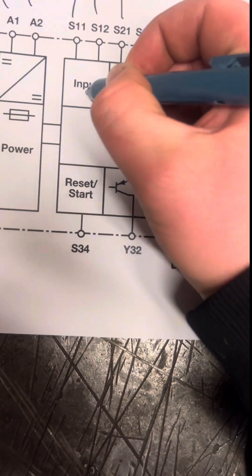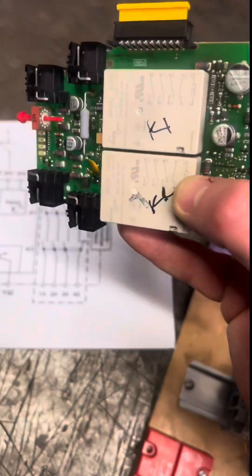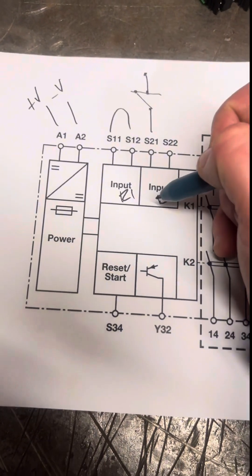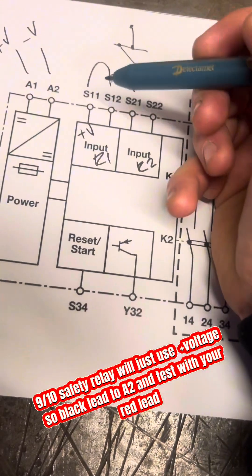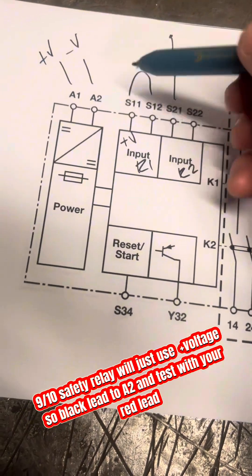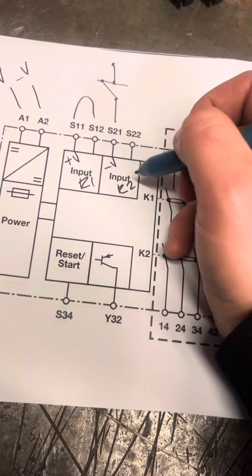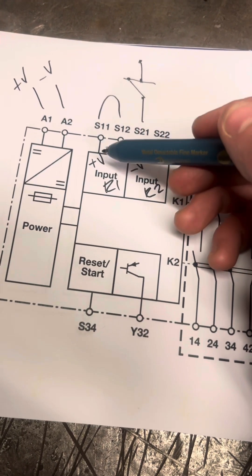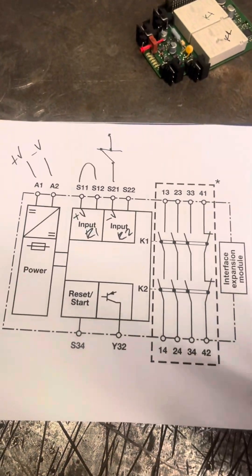Your channel one is K1 and channel two is K2. That's what one of these looks like inside — we had one fail so I took it apart so you can see the two main relays inside. That's what makes your channels. Channel one is working on plus voltage, so when testing you want your negative lead on A2 and test your positive lead across these two terminals, or each individual device as you go through fault finding. K2 uses negative voltage on the short circuit protection — if there are any shorts it's going to see positive to negative, and that's how it knows if there's a short across the circuits.